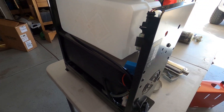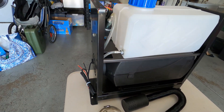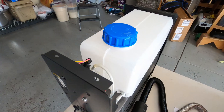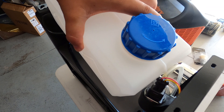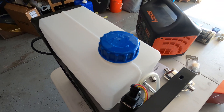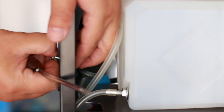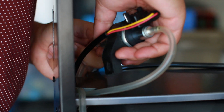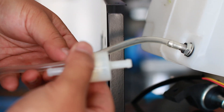Here's a closer look at the innards of this unit. Right off the bat, there is no fuel filter included. Hence why we picked up this aftermarket one. The fuel tank just sits here - the case is what secures it down. So I'm going to locate and install the fuel filter in between the tank and the fuel pump right here. To have better access to the fuel pump, I'm going to take this screw off. Here's the full length of the tube - I'm just going to snip it somewhere in between and put the filter in line.